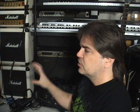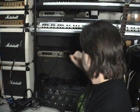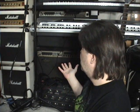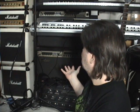Whether that load be in the form of one speaker or one more cabinet that is actually 4 speakers that total 8 ohms. So it's just another 8 ohms and 8 ohms. So now I have 4 ohms on that side and 4 ohms on that side because I just hooked up an 8 ohm cabinet over there and an 8 ohm cabinet here, plus I'm using the 8 ohm speaker that's on each side. But now that 150 total watts, 75 and 75, goes up not quite double. So now my amp becomes about a 250 watt amp. From 150 to 250, it doesn't quite go to 300, but it will go to about 250 watts RMS at 4 ohms per side. So that's what it becomes.